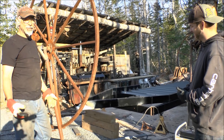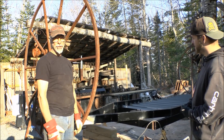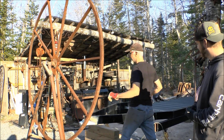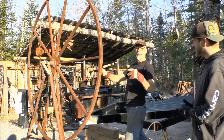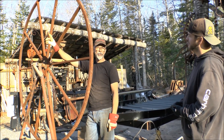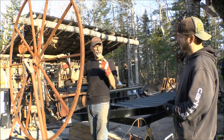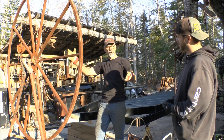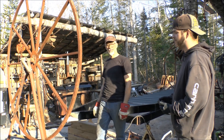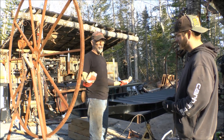And then we've got sort of the dream trailer welding setup. I've never seen it before — been in a lot of shops that built trailers and big stuff like this, and it's a dream to be able to move the whole product around. Actually, where they did do that was in Trenton, Nova Scotia — they used to build rail cars and they had a massive setup. From what I understand, they used to flip the whole rail cars around to do the welds, so you could position all your welds as flat welds. It came out much better quality — if you're going to have a road-going thing, it's the best quality.